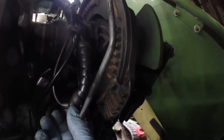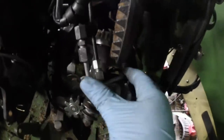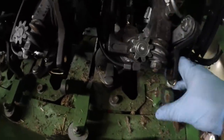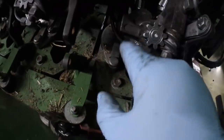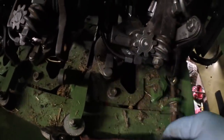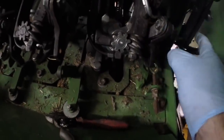You know, I wouldn't say priority. They're on a system that is, if one of these lines breaks or disconnects or something weird happens to it, it will pump the grease through that. It'll pump it out this line, and it'll starve the rest of the system. So I don't like that, because starving your system for grease is never a good deal.